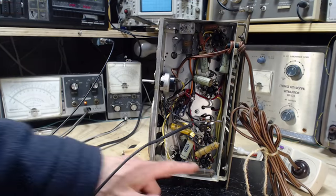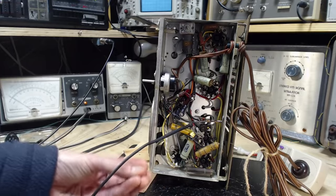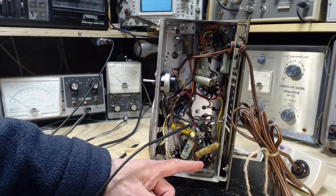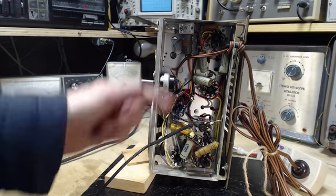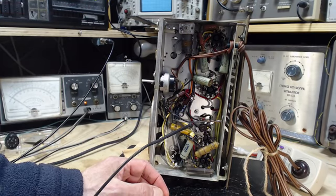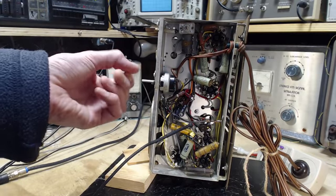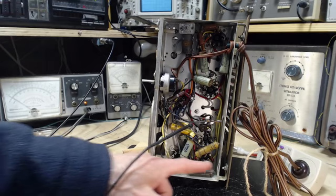But you want the two tubes here, the rectifier and the output tube, to develop a lot of thermal energy, a lot of heat in their cathodes. Not so much for these guys. So you want the wattage to be down here. And that's why that's a 35, and this should also be a 35L6. The 35 volts coupled with 150 milliamps gives you a lot more power than the 12 volts coupled with the same current. So you get hotter tubes because these guys are working hard. These other tubes are loafing along doing signal amplification, and their load is another tube that doesn't draw much. These guys up here are kind of on vacation, but these two are working hard.